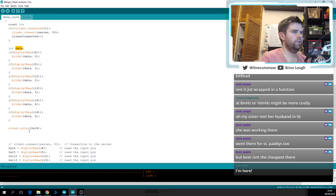And let's comment. I'll put that back in the way it was. Yeah, I think it's the println. Anyways, if you just did a client.print, you wouldn't have to add the characters. But is it a slash n? I can never remember. And because we're only going to send one byte of data, I'm going to get rid of the Y one as well. So when the client is available, the server will just read the next available one instead of reading up to Y.